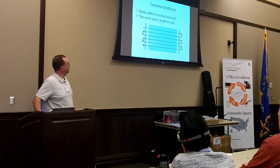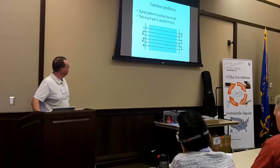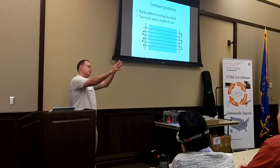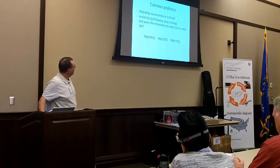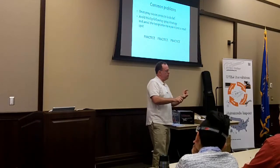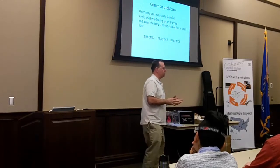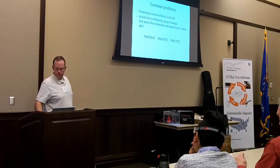If you overlap too much, there's too much paint accumulation and it runs. If you go too slowly, gravity will have its way with the whole deal. Another common problem: if you go back to touch up a thin spot, you get that area nice and wet but you get overspray all around it — dull, hazy, and dusty. That's why you paint the hard-to-reach places first and then progressively work to the easiest stuff last.